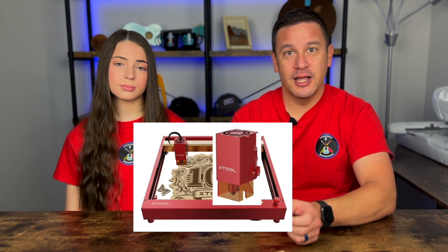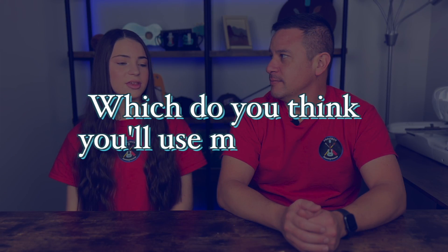When you push it up to 100%, it's powerful. I think the 10-watt system is really good at dialing in some engraving and marking, whereas the 20-watt really shines when it comes to cutting. And it's really easy to change the heads out. So if you have a 10-watt D1 Pro and you want to change it out to a 20-watt to get some different capabilities, you can just buy the 20-watt laser head and install it really quickly — snap in the wire, put it on the gantry, swap the power brick, and you're good to go.